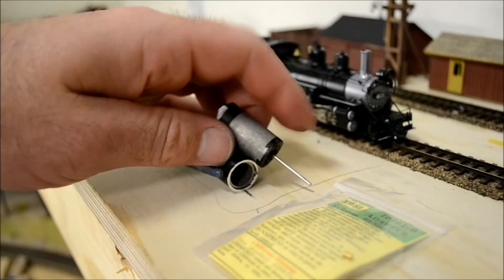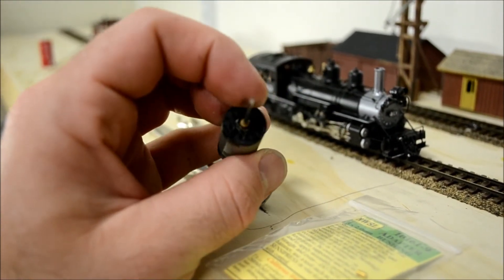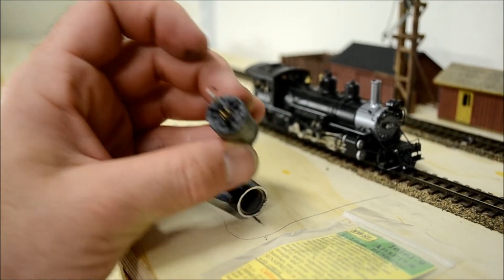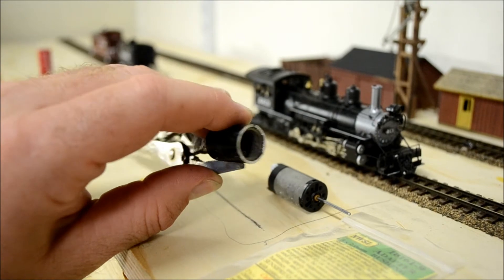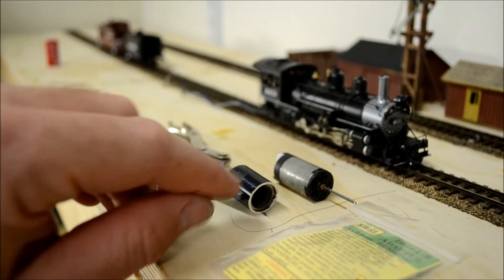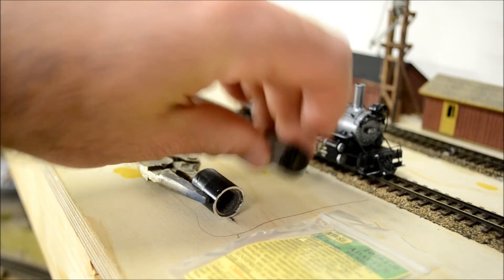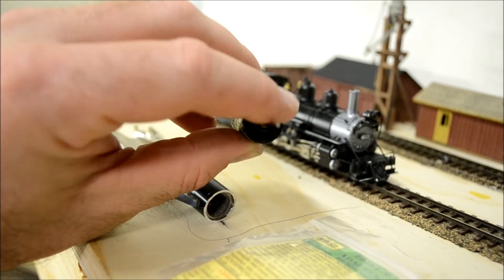Here's the motor I used — it's a Maxon seven-pole coreless motor. One thing about this, at least for the Westside Model, the holes are slightly too narrow, so it won't fit in a stock mounting plate. What I did was take the old motor, cut the end off where the motor shaft comes out, and I've got an end mill. I milled the back perfectly flat, then drilled two adapter holes to fit this bolt pattern, and used screws countersunk into that plate.